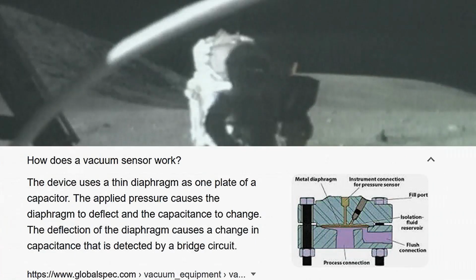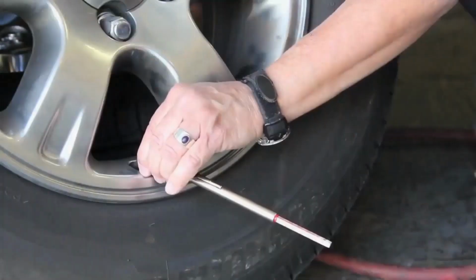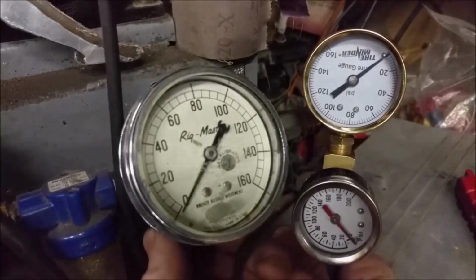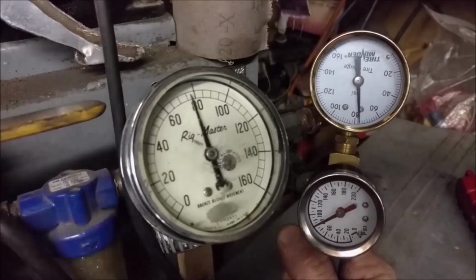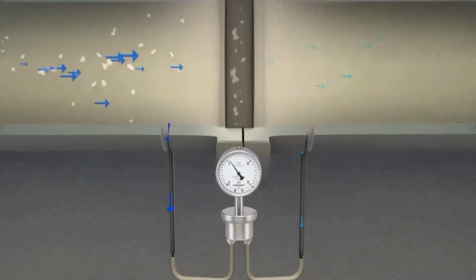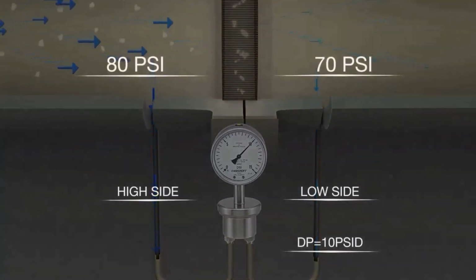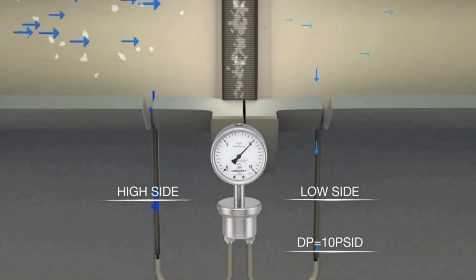And then within the other little pieces I cut out here, if you're just looking through them, this particular one, you can have different gauges. If you take a pressure gauge to measure the tire pressure in your car or whatever, right? Put it on there, it's only measuring just the pressure inside the tire. It's not bidirectional. It doesn't give you the total force between the inside and outside, because it would then have to cancel the outside air pressure on it. But when you have a different gauge, a differential gauge, right, it shows you the difference between the outside and the inside pressure on there. That's the total pressure against the wall between the two, or lack of atmosphere.